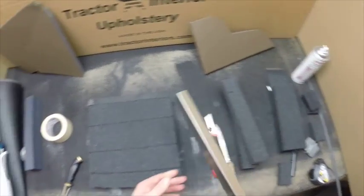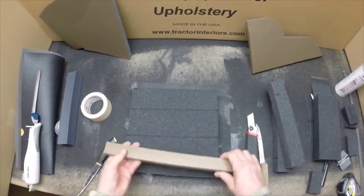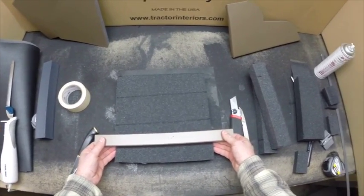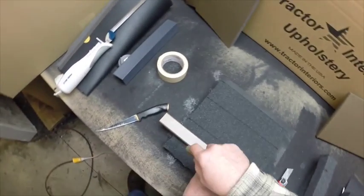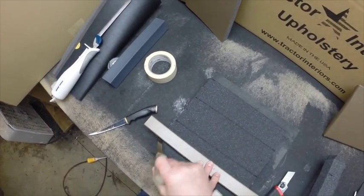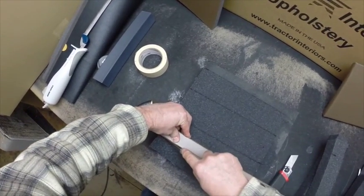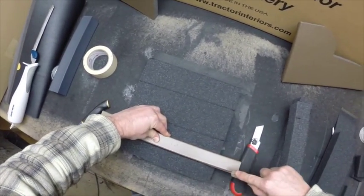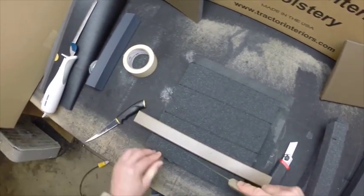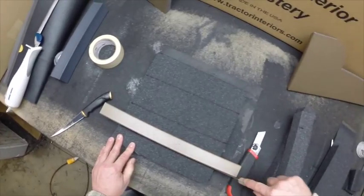What you want to do is you want to have a straight edge to follow. This is just a square piece of tubing here, so we get a 90 degrees. We can try to keep this cut parallel to this surface instead of go off it at an angle like that or like this. Keep it 90 degrees to the surface. Drag it across there. Not too much pressure.